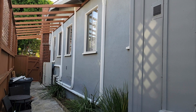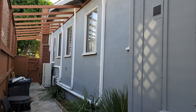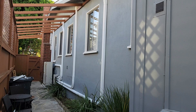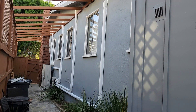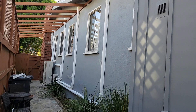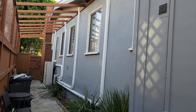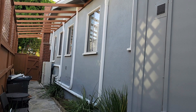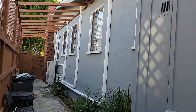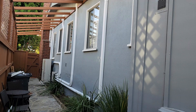The outside work is complete. We put the line set covers on, and the outdoor unit and branch distribution box are all wired up — the unit is operational. One tip regarding the line set covers: you can see we've got some pretty long lengths and they come in 8-foot sections. I would cut them in half and join them, using 4-foot sections. Getting the top cover to snap in over a full 8-foot run is difficult — by the time you get to one end, the other end pops out. So if I had to do it over again, I would cut them in half.